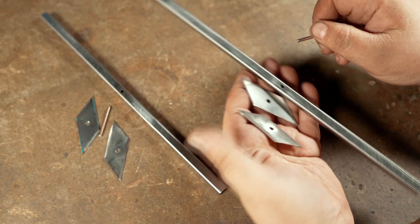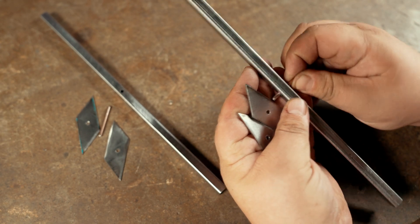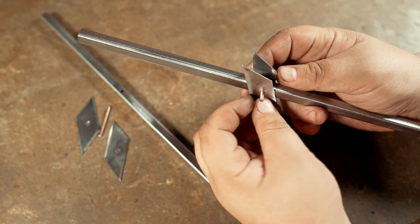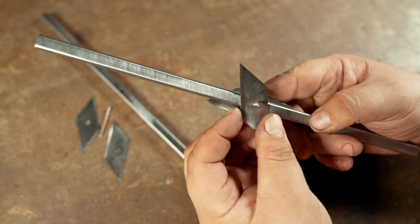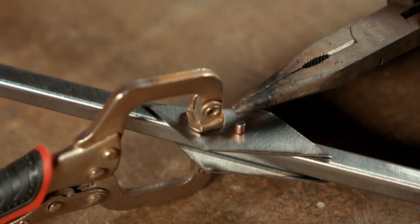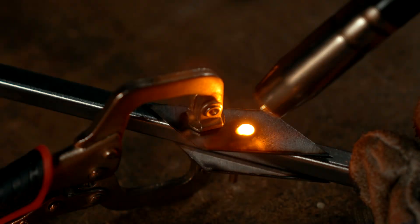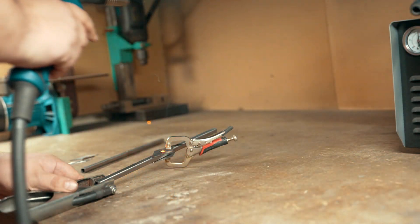This hinge will be from the same bar for the TIG welder. Since the diameter is 3.2 millimeters, I used a drill bit as close to 3 millimeters as possible. Mirror to each other, on each side these parts will be welded to the hinge so there was a possibility of rotation. I make one weld point on each side — I think that will be enough. The load on this joint is very low. I do everything with the help of angles, although it's not obligatory, but I always want it to be neat and beautiful, even every little thing.